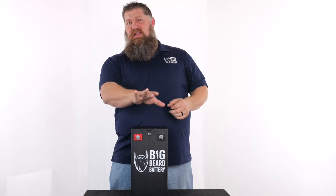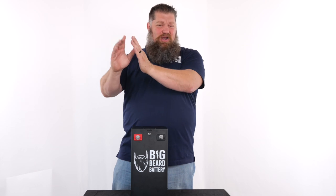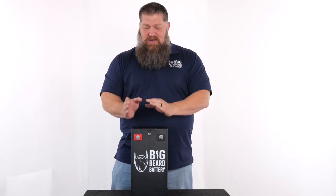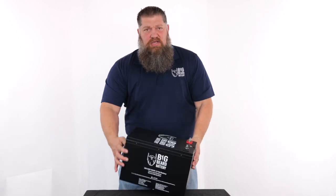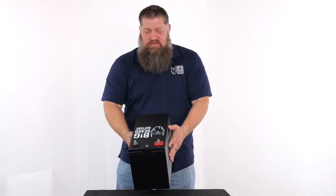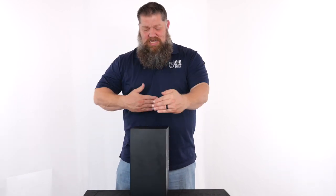The 24-volt variety also has its own built-in 200-amp breaker, so it takes up less space on the wall and you don't need an external breaker. It has an on/off feature and can be placed in four different positions. One thing we really don't want to do is set the battery with the posts down — all the battery weight would sit on the BMS, and that applies to the 24-volt as well. The great thing is you can push it up against the wall and it doesn't take up much space.